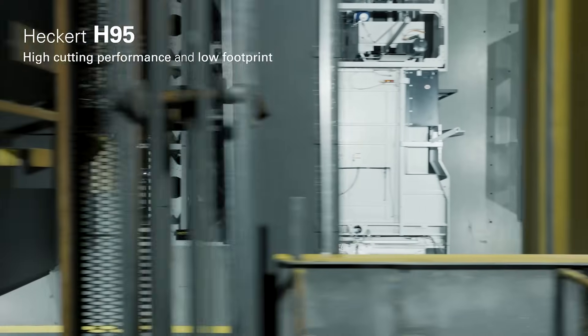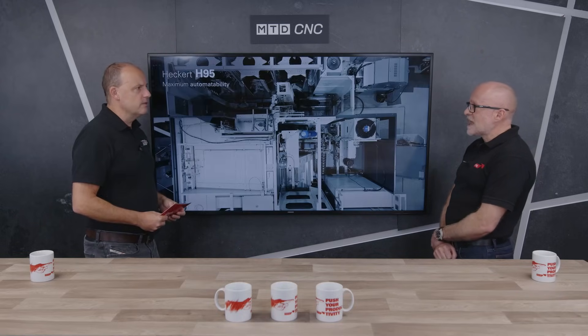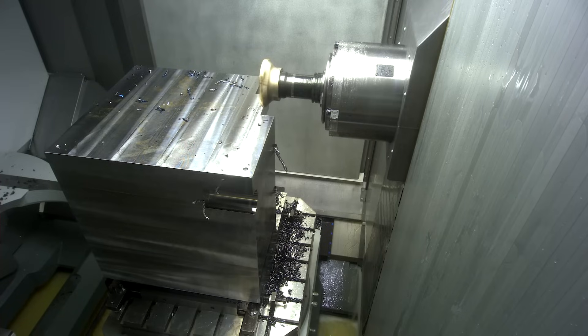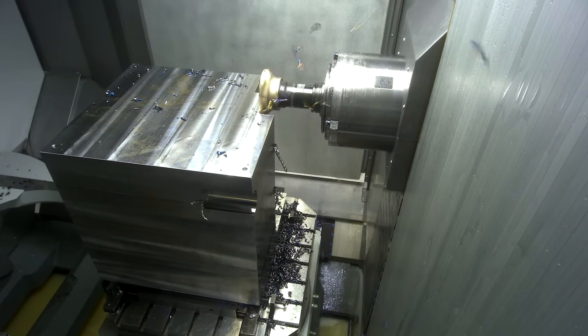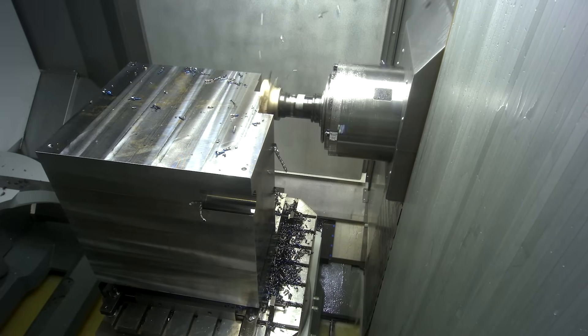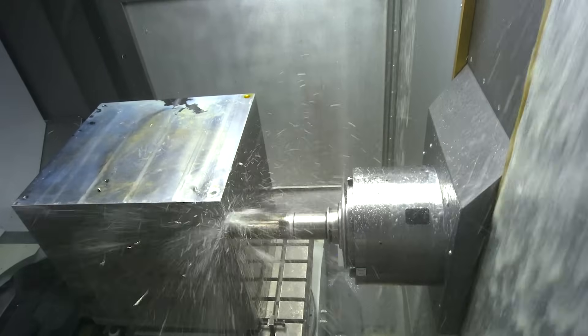What sort of part and application would you be putting on something like this? From the slide show, we're talking about the energy industry, nuclear and things like that — pretty industrial parts. It can be for anything, but the main sectors for us are transport and industrial markets, and also aerospace and energy markets. It's got capabilities on the spindle range up to 30,000 RPM for soft materials like aluminium, and it's also got some very heavy duty stiff spindles for cutting more difficult materials.